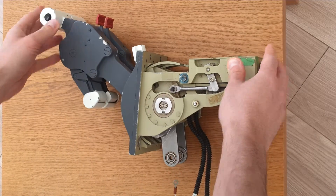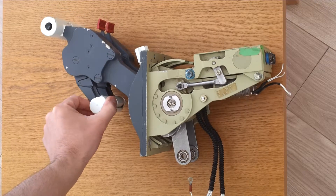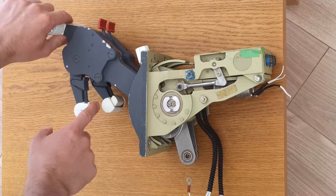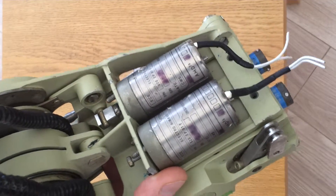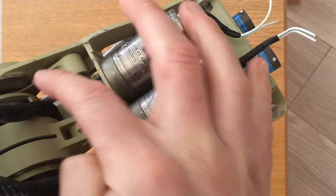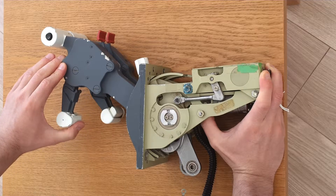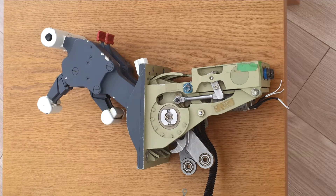For the reverser action there's two locks. There's a manual lock release which is this here, and that allows the lever to lift into this new lock detent which is then only released when this solenoid operates. It's operating in a pull mode — it pulls this down and flicks this little tab over here. The solenoid unlocks that, which allows the reverser to be extended, which then operates the engine RPM directly. My understanding is that this solenoid operates only when the thrust reversers are fully deployed.